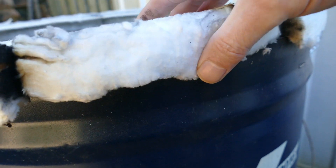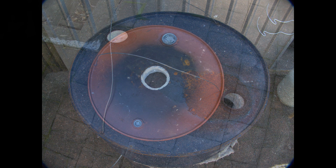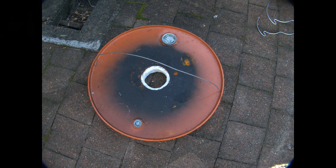Also on the flue, I used the existing holes — one of which was the fill hole for the lid — and I made another one which was a bit larger. But I think it actually works better with a central hole. Just block those two up and put a central 6-inch diameter hole in the lid. Then if you cut the ceramic fibre to about 5 inches, that stops any paint getting burnt off the lid because the ceramic fibre actually absorbs the heat.